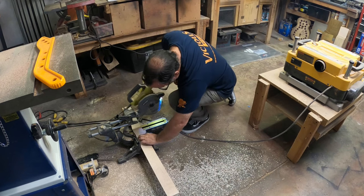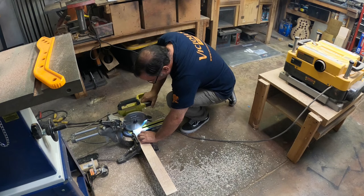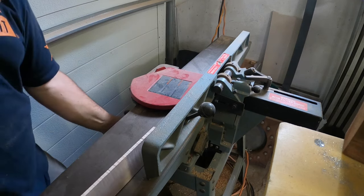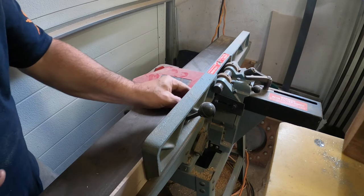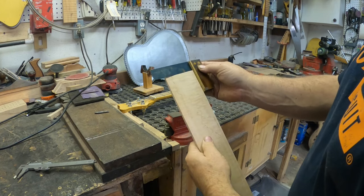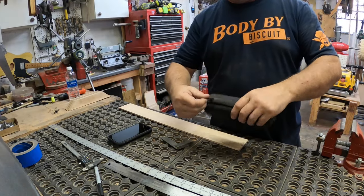With that sorted, we can find the best-looking part of the board and cut it to length. There are actually no parts of this board that didn't look good, so that job was easy. Make one side perfectly flat for measuring and layout, then check for square. When all that's complete, we have a fretboard blank — that's well, blank.